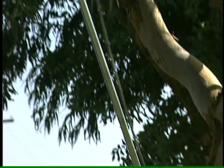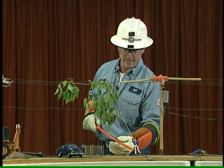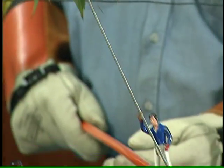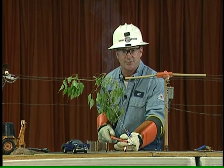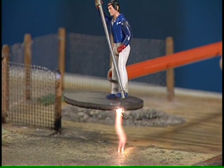Let's take a look. We'll call this guy Doofus. Doofus has a metal trimming rod in his hand — these fiberglass pruners are a lot better option. Doofus comes up, wants to trim this tree, doesn't look up and live. He comes in contact with the tree branch, and it takes that electricity back down to the ground. Remember, electricity is always trying to get back to the ground where it was generated from — it goes right through his feet back down to the ground. It's the same as coming in contact with the power line directly.